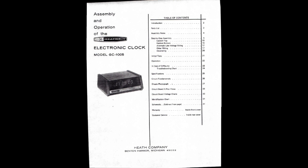So here's the clock, how it looks in the manual. And there are a couple of details — for example, assembly notes. That's just in case you only have a large soldering iron with a large tip. They gave you the tip that you can wind a piece of copper wire around the tip to make a smaller tip, to easily solder the chip and all the small components. And as you can see in the text, they even supplied that piece of copper wire to adapt to your soldering iron. I think that alone is remarkable.